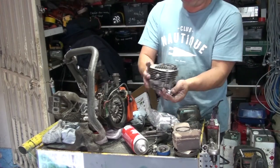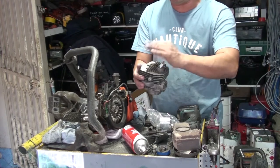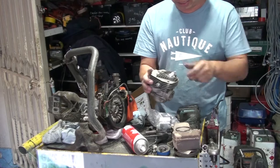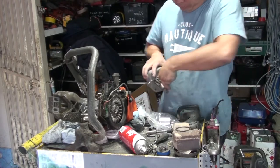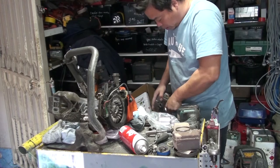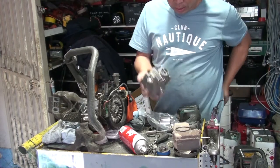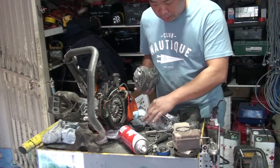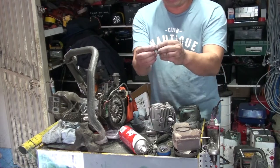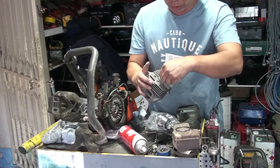And then put the spark plug in too, just in case when you put your finger or your hand, dust may get inside the piston. So tighten this one as well. If you want, a new spark plug too. Okay. And the decompressor valves, I just do a quick cleanup. Decompressor valves, big cleanup, put in here.